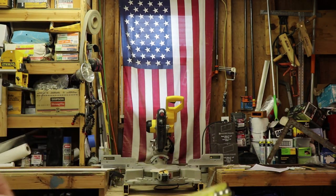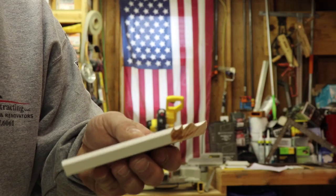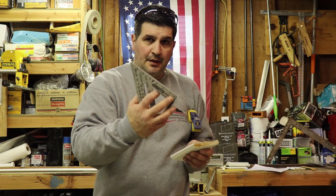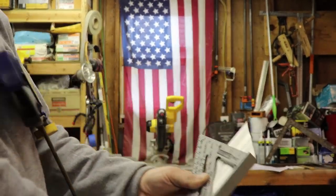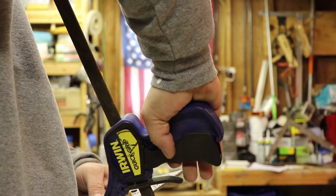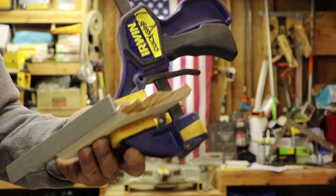All you would have to do is hook on here like so. If you're measuring your outside corner, you have nothing to really hook to. There are a couple of tricks I do that make it easy. You can take your speed square, put it to the short point of your cut like this, then take your squeeze clamp - this is a little exaggerated, I have smaller squeeze clamps in my van - and you could hook on right here and have a nice accurate cut if you're by yourself, which comes out really accurate.